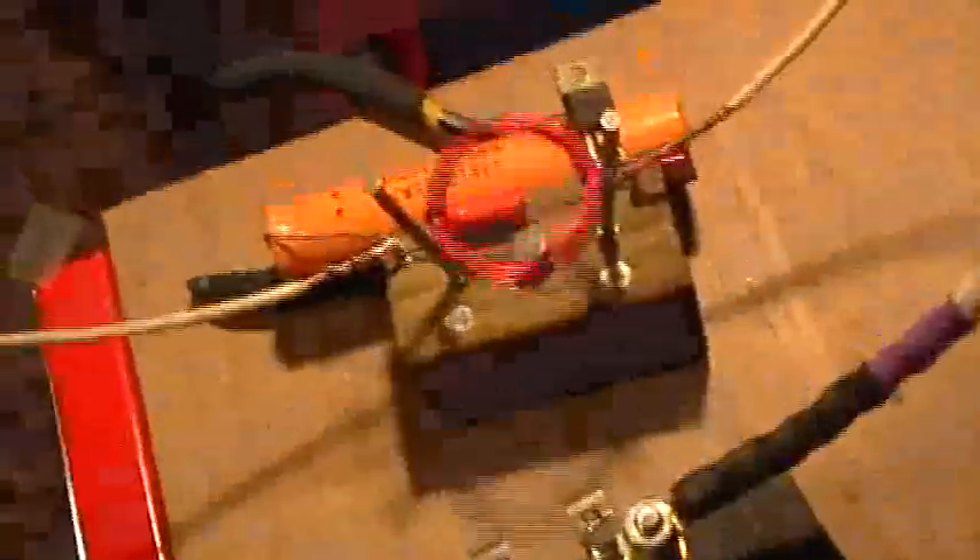And like I was saying, the diode is critical. You need an ultra fast, high voltage, high current diode in there. This is the only one out of my stash that worked. I tried 1N4000 series diodes, I tried a 1N5400 diode, I tried 1N34 and 1N60 germanium diodes, and this is the only one in my stash that works, and that's the last one of those that I've got. I've got to try to find some more.